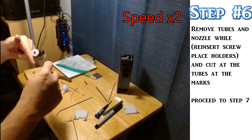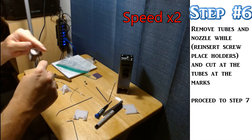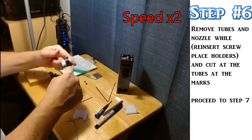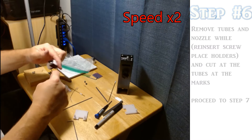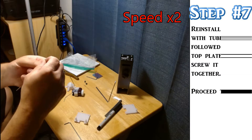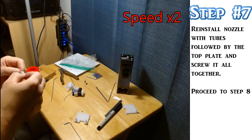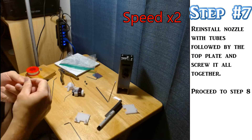To cut the tubes, I'm using the same tube cutter that I had last time that I purchased off Amazon, which I'll put a link in the description. Another way you could do this is with a hacksaw — just be careful that you don't collapse the tube when you're cutting. Go slow. I decided to install some plumber's tape on my tubes, just to make sure they get a nice tight air seal. I don't know if this is necessarily needed, but I did it just because.